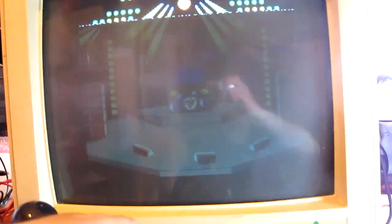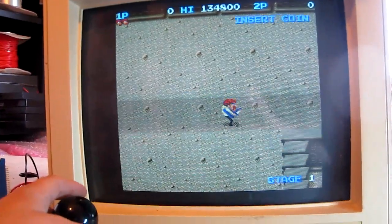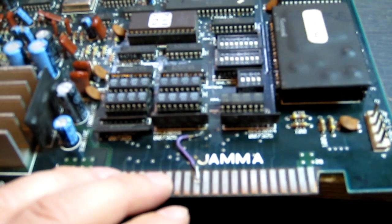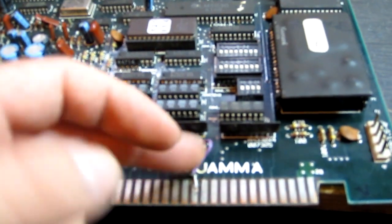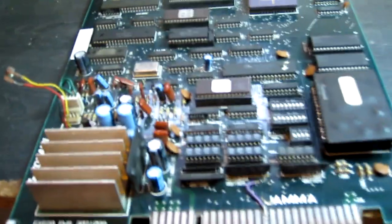That's the replacement custom fitted and it's a nice coloured game now, so that's one problem fixed. I've replaced the bad opto coupler, and I just need to replace this horrible bodge wire that someone's put on here — don't like that at all — and then replace the volume control, and then that should be everything done.